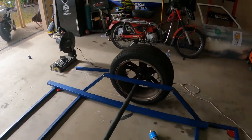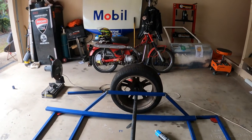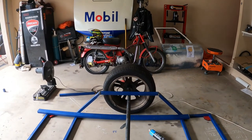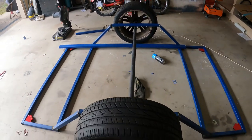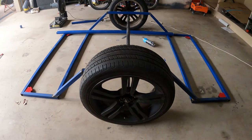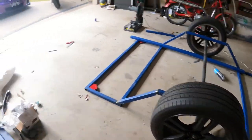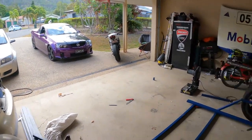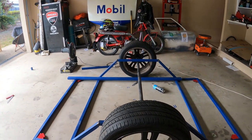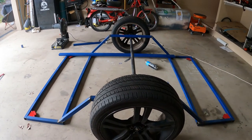So where the top of the frame is now, how it's basically sitting on the axle, that's actually going to be about an inch above the wheel at full suspension droop. So it's going to have plenty of clearance on the wheel. So yeah, now it's just got Povo VE wheels on it at the moment. VE Series 1 SV6 wheels. And it's going to end up with SSVs like my ute. But I've done all the measurements, and then plus, I think it was 15 mil for a set of 245/40 19s. So yeah, it's all done and measured out.